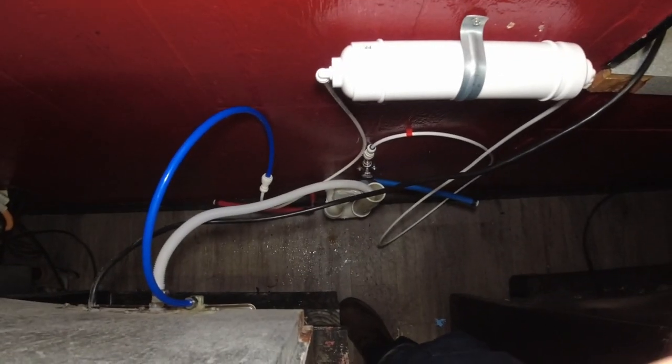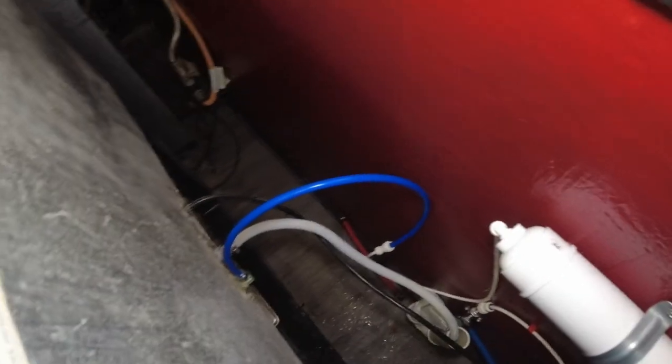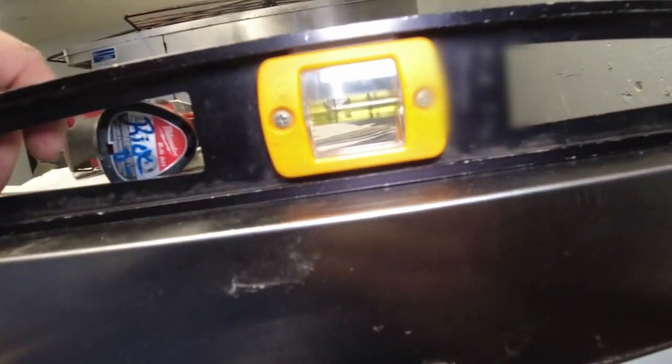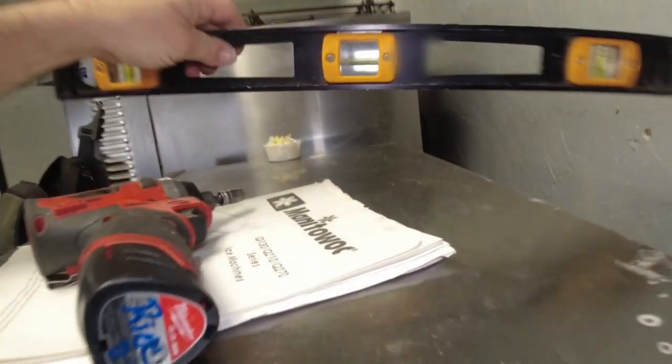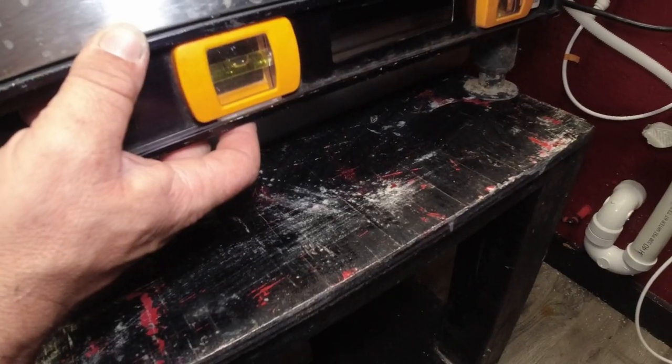What we ended up doing is putting blue thread tape underneath and re-tightening it around there, because they were using a barb fitting - barb fittings don't work real good on that kind of plastic. It really should have a piece of PVC on the back with a standoff pipe, just like they've got on the back drain, and then put the tube on it - but you don't want to double-trap it like they did here. With the way this thing is set in here, they're going to move it and snap off the PVC. The water filter isn't big enough - I told them that. There's only so much you can do; I don't carry all this stuff in my truck to rebuild a whole store. It's pretty level except for that big bump in the middle.